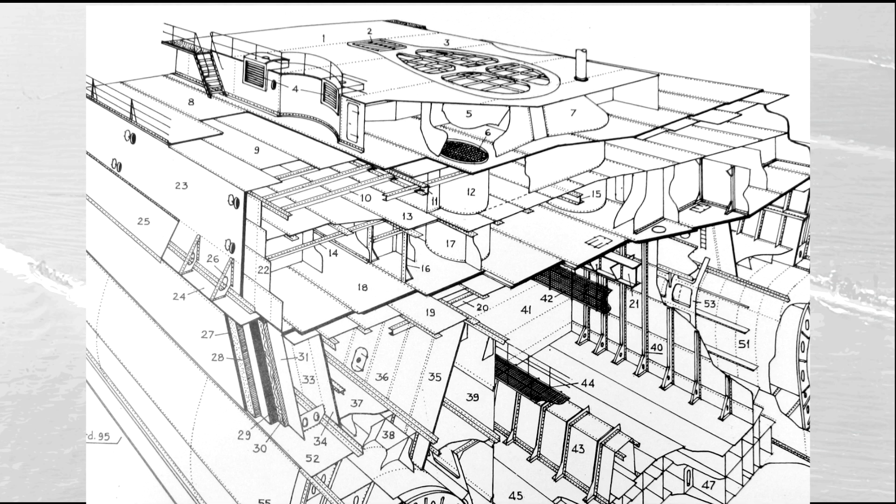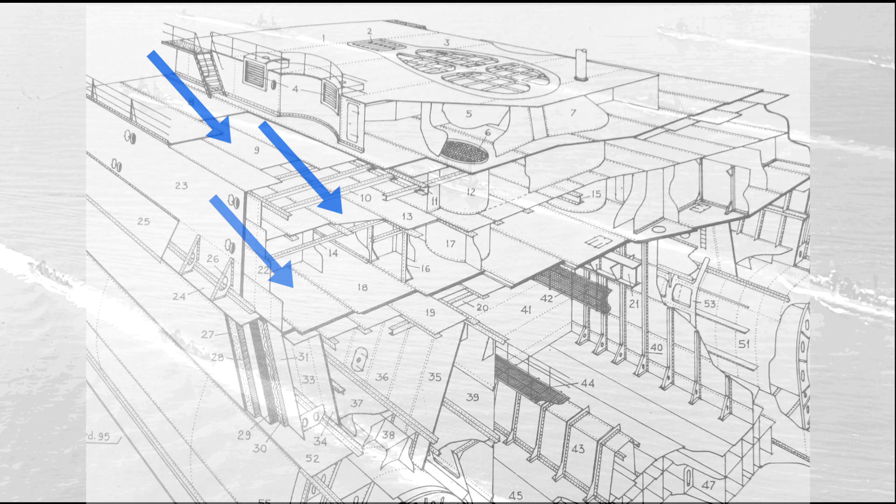The horizontal protection consisted of three different armor decks of varying thickness. The upper deck had a 36 mm armor plate for capping enemy shells. The main deck had a 12 mm plate of extra-resistant steel, while the gun deck had a varying level of thickness ranging from 90 to 150 mm, depending on the area considered. Tests carried out in the 1930s showed that such defense could do little to fend off hits from bombs above 480 kg launched at steep angles, although the events of WWII showed that no battleship was immune to such a threat.